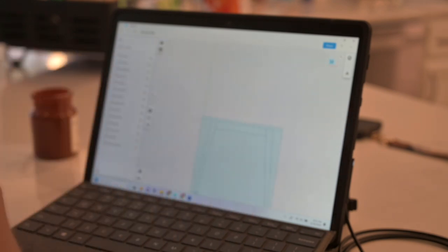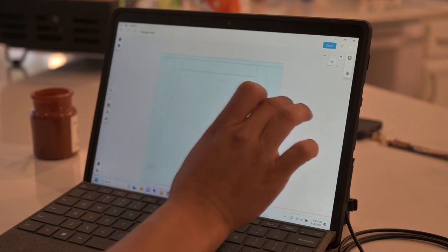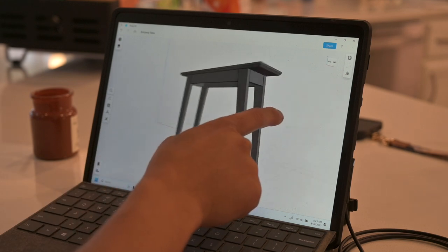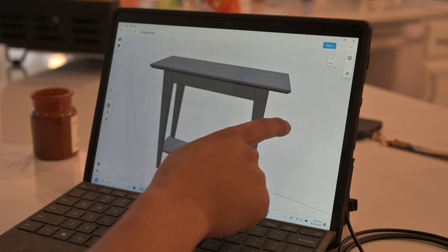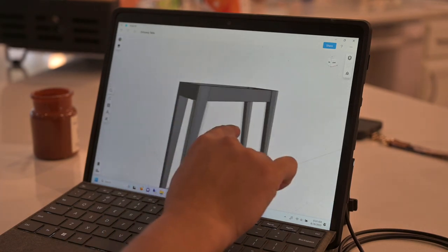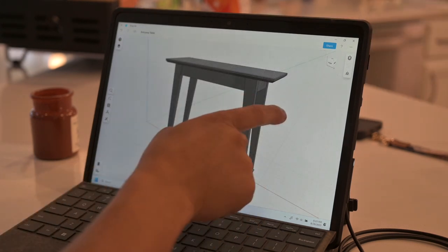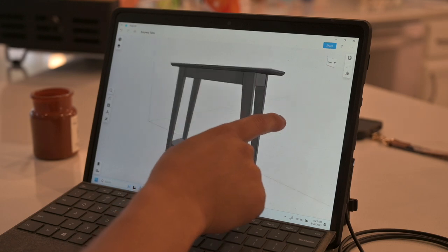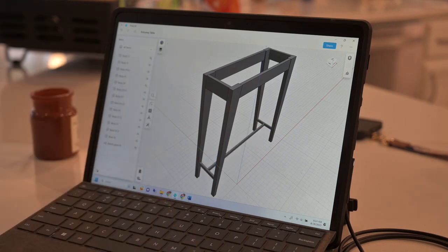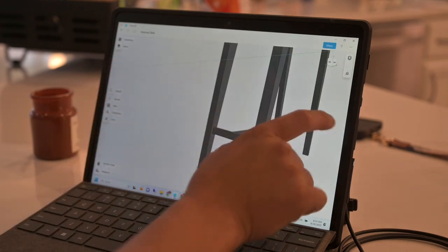As with all my projects, I produce my designs in CAD. The design starts off as a very rudimentary drawing made up of polygons. I went with a simple modern design comprised of splayed and tapered trapezoidal legs, splayed side aprons with a 1/8 inch reveal, and a front and back apron with also a 1/8 inch reveal. The top is 7/8 of an inch thick with a sizable underbevel, and the lower shelf is 5/8 of an inch thick and has an underbevel along the ends. The lower shelf is held up with a small H-shaped stretcher.